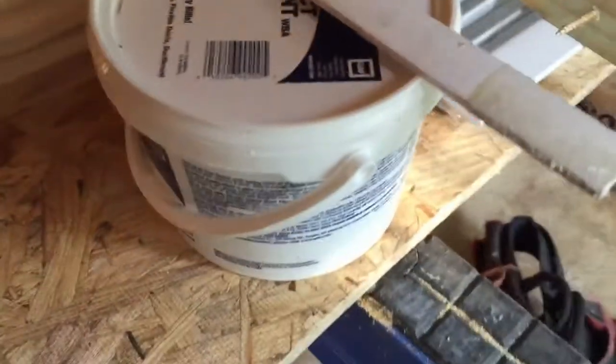You've got two different styles — you see this style here, it's got the little folded edge, and you got this style here. Depends on where you're purchasing; one came from Lowe's, one from Home Depot. They're essentially the same. You're going to need some duct tape — it's aluminum duct tape. You're going to need some duct sealant. Your register boxes. Some zip ties. And of course, you're going to need your R6 insulated duct. This is a 6 inch duct, and we're going to be putting this stuff in and getting everything sealed up.